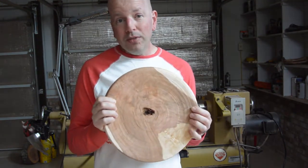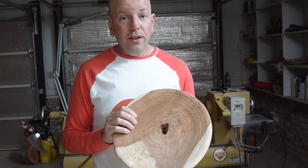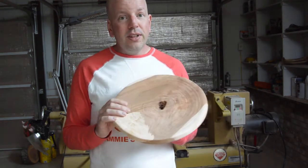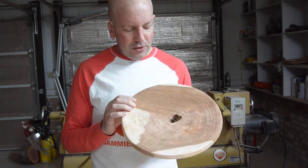I am going to take a gamble that this is air dry enough to finish turn. It was quite dry in there over the winter because it was exceptionally cold this year for an extended period of time when the air was quite dry. Plus, it is air conditioned so the moisture inside was quite low. That is why I decided to try to final turn this.